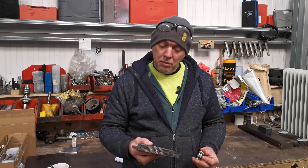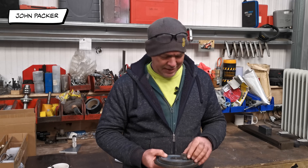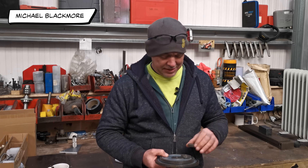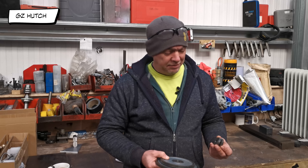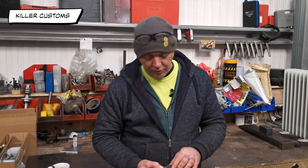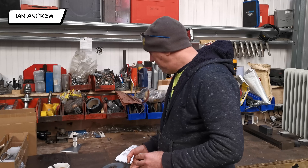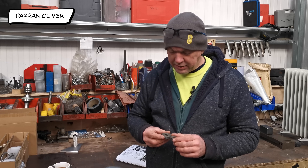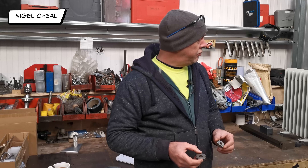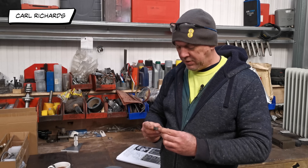Basically I bought the conversion gears for Chuck Norris the lathe. It's an imperial machine and I'm a metric fella, as is pretty much everything these days including the project. I need to be able to single point thread cut metric gears, not imperial ones. For the sake of standardizing everything I'm going metric. This is a compound gear - 27 teeth on the smaller ring - and I've got some different stud gears as well, a 24 and a 28. The combination of these and what's on the lathe already means I should be able to cut metric threads.